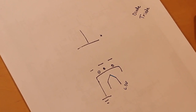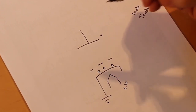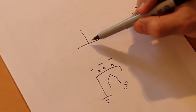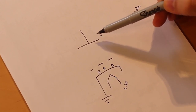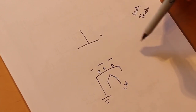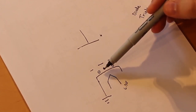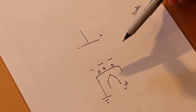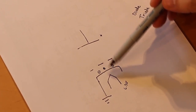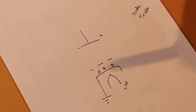The triode has an inherent problem: when the grid lets the electrons fly by, they come all the way up and hit the plate. The plate then has a sudden influx of electrons, so its potential with respect to the cathode tends to drop a little bit. When it drops, the difference between the two gets less, so it has less attraction on the electrons and pulls fewer up. This creates a sort of oscillation — as electron flow slows, the plate potential comes back up, electrons flow again and smash into the plate, bringing it back down, creating this weird oscillation.